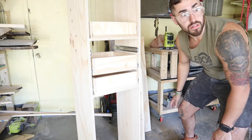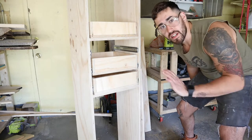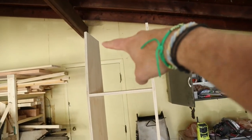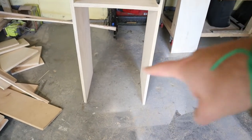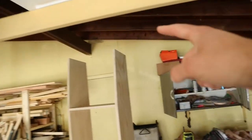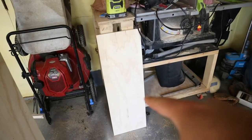We also need to get brace pieces for the top and the bottom. Now that we know all of our drawer boxes fit in nice and smoothly, I'm going to do some extra bracing — one piece at the top, another at the bottom. Both pieces are 16 and a half inches long and 3 and a half inches thick, which will give a little more stability. I also already cut my brace pieces for the top shelf insert — going to the left and from the wall forward — so that piece will be nicely supported as well. Once these pieces are cut, we'll get them installed and then we are ready for install.